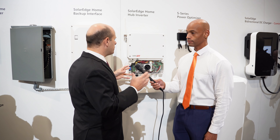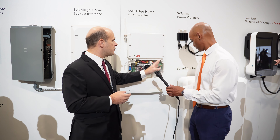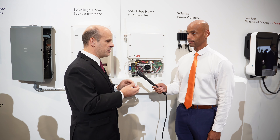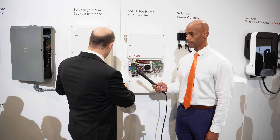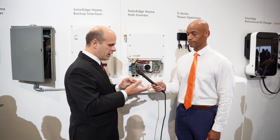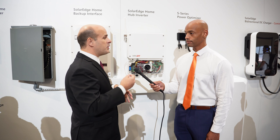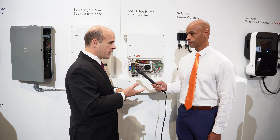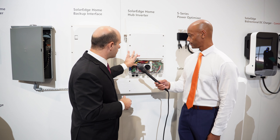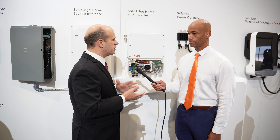The second communications is our ecosystem of accessories, which uses another wireless protocol called Google Open Thread. The battery and the EV charger we talked about earlier use Google Open Thread. Increasingly we see on installations that when they run a wired communication, they don't know where the devices are and need to make that communications cable — and sometimes they make mistakes on the pinout, which is an area of reliability. Sometimes we're seeing RS-485 or CAN bus — these are old and slow protocols, and software updates take a while. The wireless communication is faster. From an aesthetics perspective, you don't have a wire running on the wall, so it looks cleaner. So there's wireless to the home and wireless to the accessories — faster, more reliable installation, and it looks cleaner at the same time.